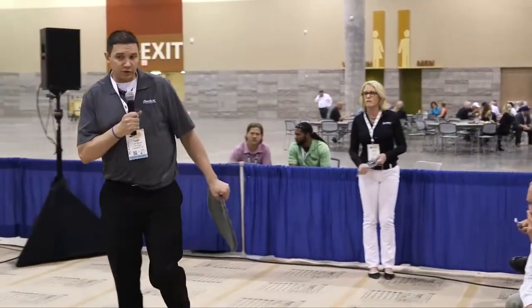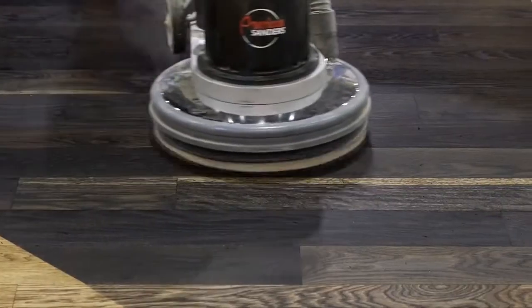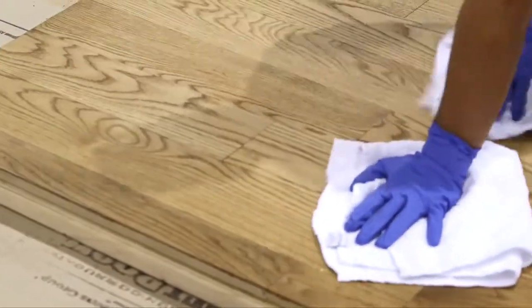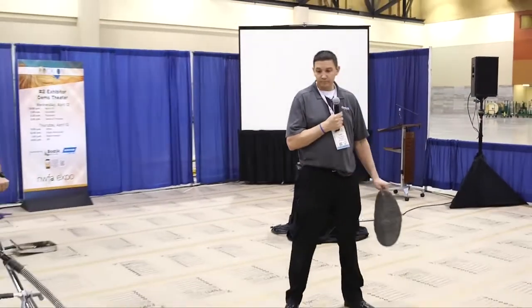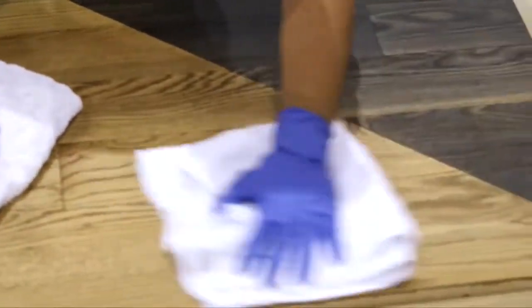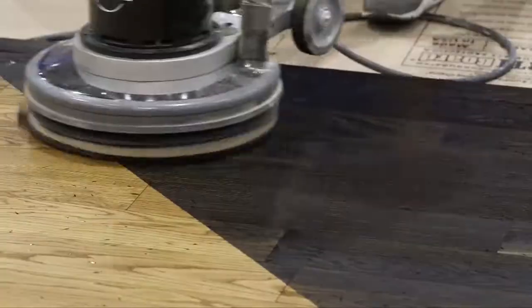The question was: some customers do a coat of Quick Coat penetrating finish and then do a second clear coat of the neutral. That would just be adding in a second coat of protection without altering the color at all. We've found the second coat does very little to change the color — it's more to make sure the grain is fully saturated with the finish so you get maximum protection. The neutral would achieve the same effect. A second coat does not tend to darken it significantly. Some of that would depend on how adequately you did coverage on the first coat — if it was too thin you might get a little color change, but at the recommended rate it would be very little to no color change.